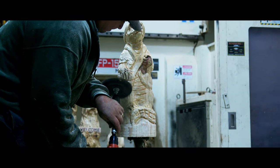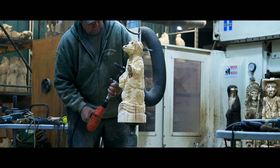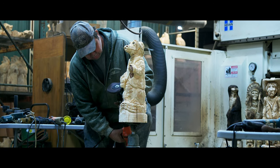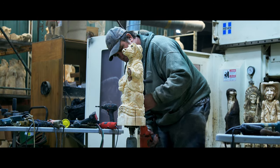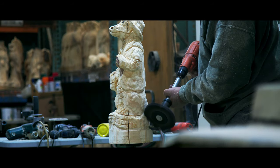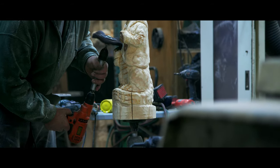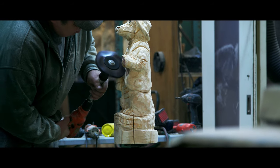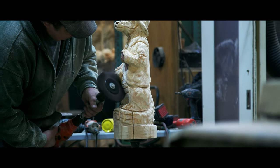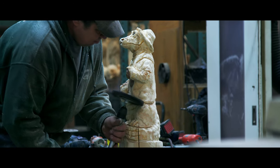We're going to get the old nylon brush out and wipe him down a little bit. The main thing about these nylon brushes is make sure they are one-directional — make sure all the bristles lean one direction, and you want to make sure it's spinning in the direction that they're leaning. If you go the other way, you'll wear out your brush real quick, and you can tell it won't be smooth when you're holding it — it'll be kind of bouncy. So make sure you're running them the right way.